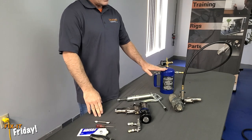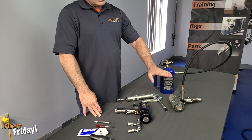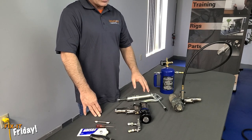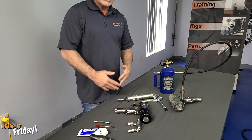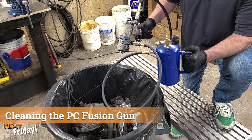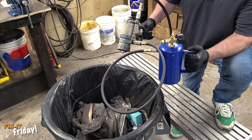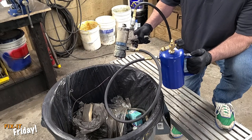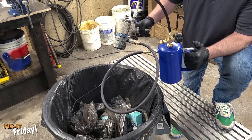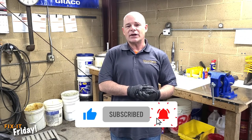If you're using the flush pot, we just recommend that you leave it on the flush pot. If everything is spraying well, you shouldn't need to maintain it. But every couple of days, go ahead and flush the gun out, disassemble it, service the mixing chamber, and if the cartridge is still good, go ahead and put the cartridge back on. Graco recommends five to nine sets with closed cell foam; with open cell, you're probably going to get quite a few more sets through a cartridge. Whether you use the flush pot or not, there is a procedure without the flush pot, but we highly recommend using it — it's going to get all of the contaminants out of the gun before you go to clean it and break it down. That's a cleaned-out gun, ready to either disassemble or just leave on the gun itself and store it overnight. That's this episode of the PC Fusion Gun. Thanks for watching Fix It Friday — please like and subscribe.